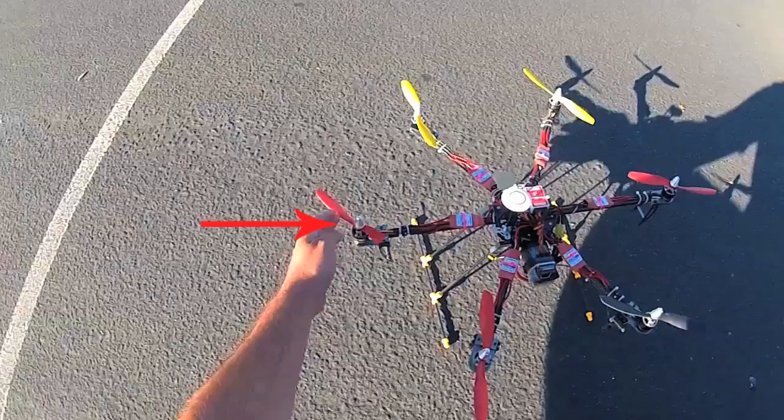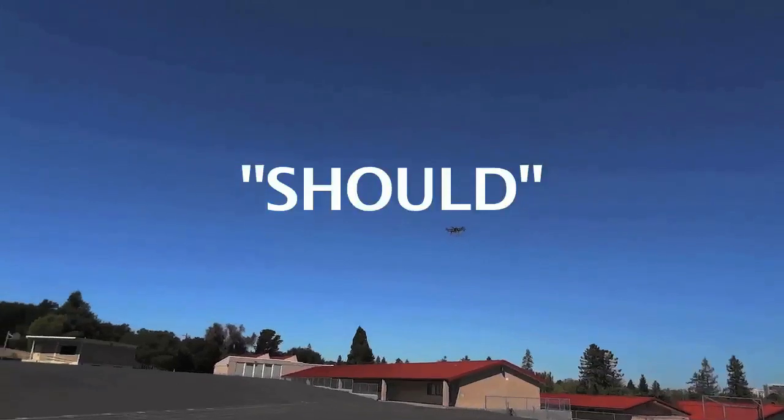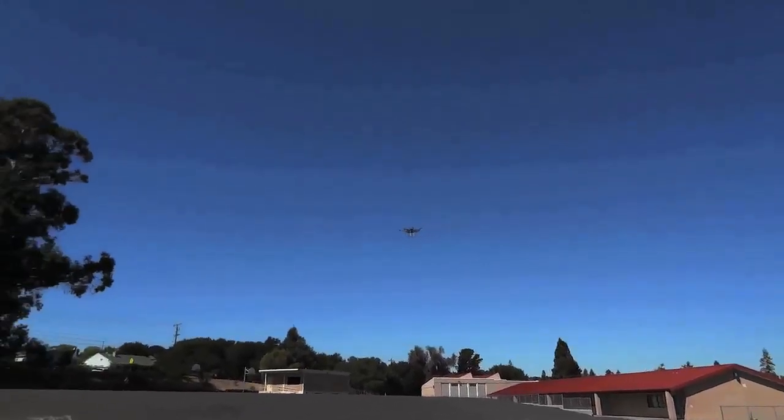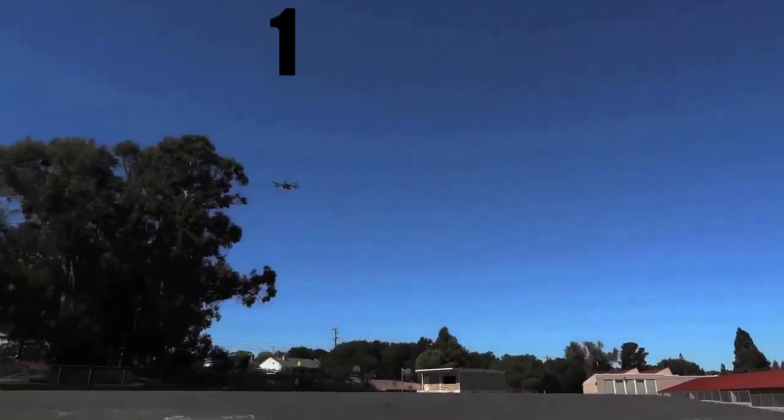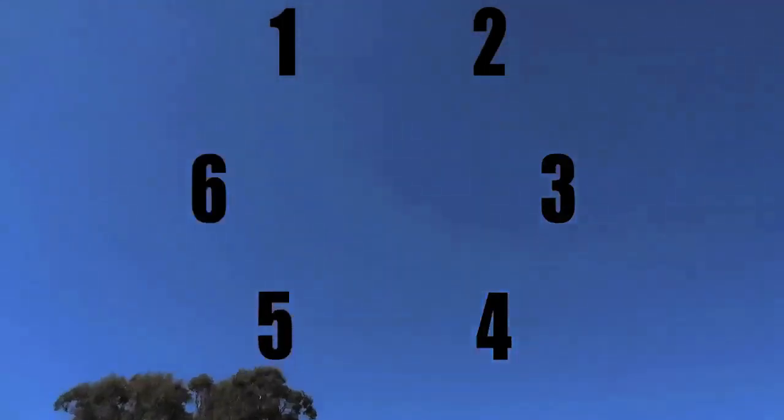Depending on how well your flight control board is set up, it should be able to do with a prop breaking or a motor stopping. Inherent stability, 6 points of rotation. So there's an inherent stability with Hexes. Now the cons is cost.